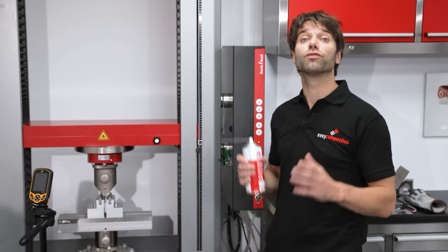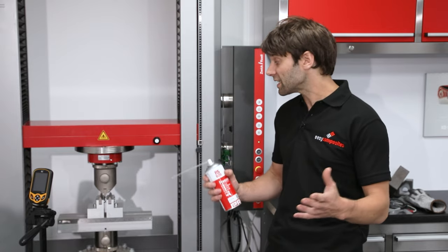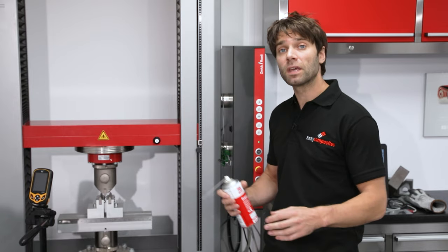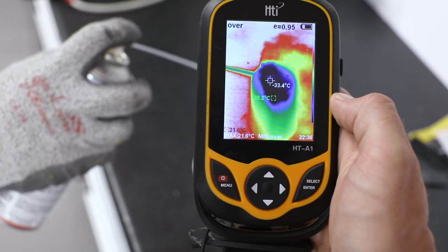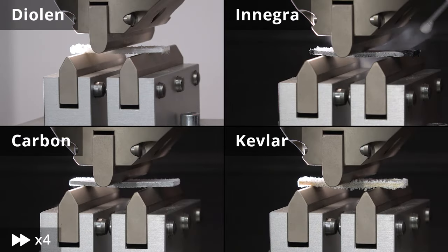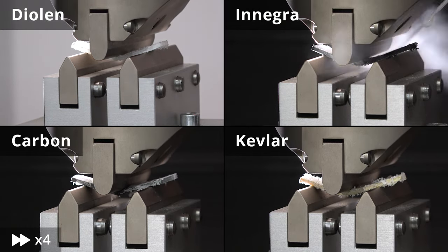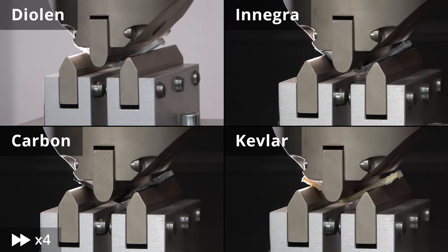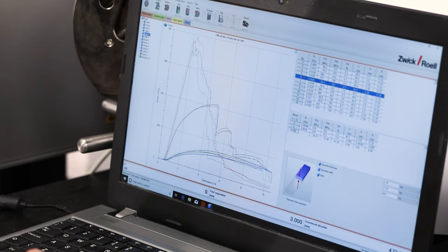That's the material testing done at room temperature, but material properties can change significantly with varying temperatures. Since these sledges will encounter extremely cold temperatures of around minus 40, I preconditioned the samples in our freezers to around minus 25, then used freezer spray to lower and maintain the temperature to around minus 45 during the test. The performance when frozen was almost identical to ambient temperature — there was a very marginal gain in ultimate strength of less than 2% for all materials, with the exception of carbon which showed no identifiable change. This improvement is not particularly significant and further testing would be required to properly validate the results.